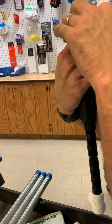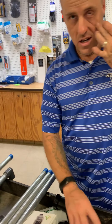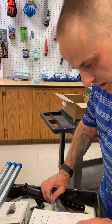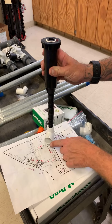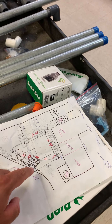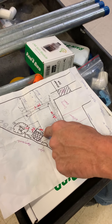So if you just had this little notch pointing right there, that's where it's going to end when you turn it on. Like right there that would make it a 90. As you open it up that would make it a half, and if you need it a little bit less, that's what that would do. The more you open it up the more range it gets. I just need to add one more of those — there should be eight total. So this is basically what you're going to have — a sprinkler right here at all these connections.